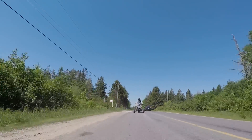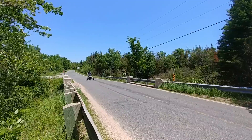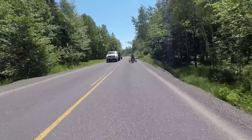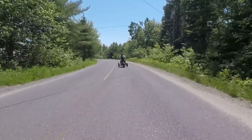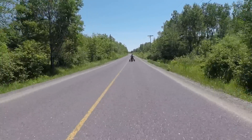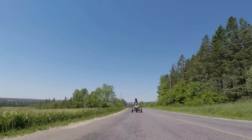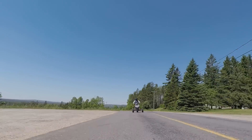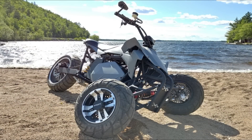The trike as a whole turned out pretty good. I got a top speed of around 110 kilometers an hour but that's at 72 volts. More voltage equals more speed and with the motor being rated for up to 96 volts it could easily reach up to 150 kilometers an hour, which is on par with most motorcycles in the same power class. For one of my first EV builds I was pretty happy with it. It's loads of fun to drive, almost like a motorcycle. I say almost because of that 30 degree lean angle limit — it wasn't a major hindrance but I did notice that I had to slow down just a bit more for the tight corners than I would have on a motorcycle. I'm going to change things up in the future to get 40 to 45 degrees out of it and add another shock in the front for true independent leaning suspension. That's it for now folks — if there are any other old videos you'd like me to add narration to, let me know in the comments. Thanks for watching and take care.